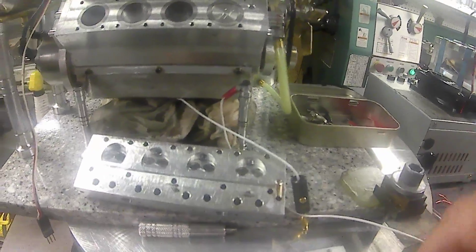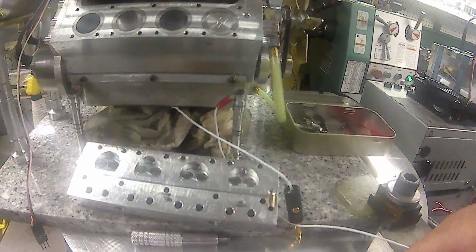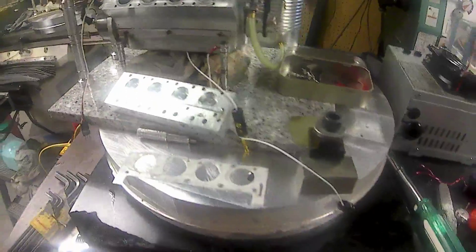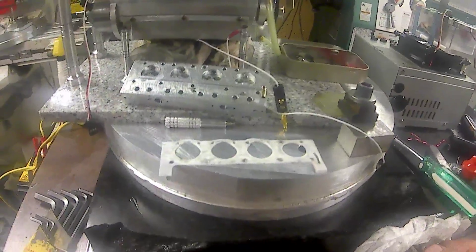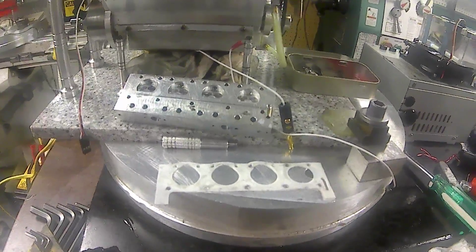What I do when I cut these out is I get that high speed and a little tiny cutter and I mill the holes — I don't drill anything. It's all done with an end mill, a little end mill. I have a fixture, a plate that goes over top, pinches the material, and then it goes around and does everything.